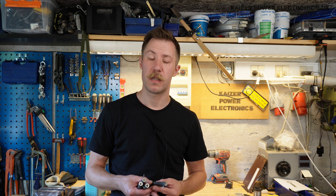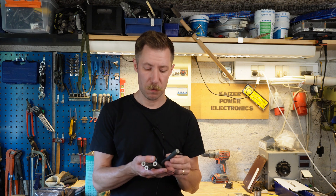Thank you for making it this far in the video. I hope that by now I've earned your like and perhaps even a subscribe to my channel. It would mean the world to me if you leave a comment — I will answer every comment. This small servo drive was not really that kind of a giving teardown, but it did contain some very nice IGBTs, diodes, and also some nice 50 ohm 50 watt power resistors — four of these go in the power resistor drawer. Very nice to find 50 ohm; that's quite suitable as a load when doing 50 ohm measurements.